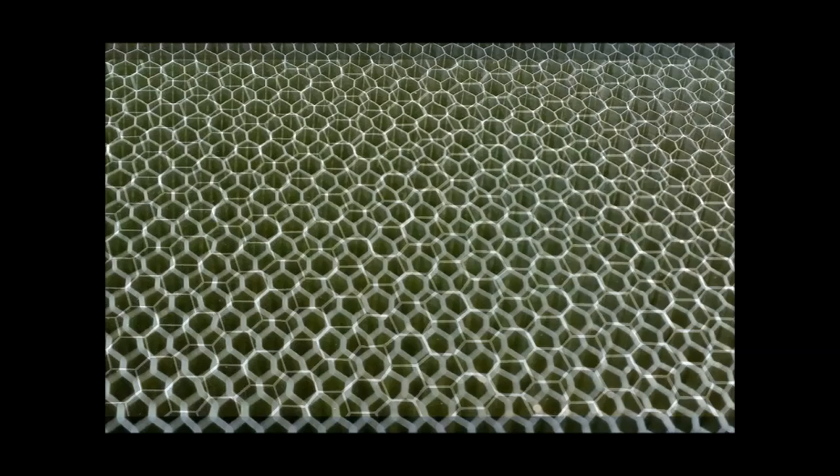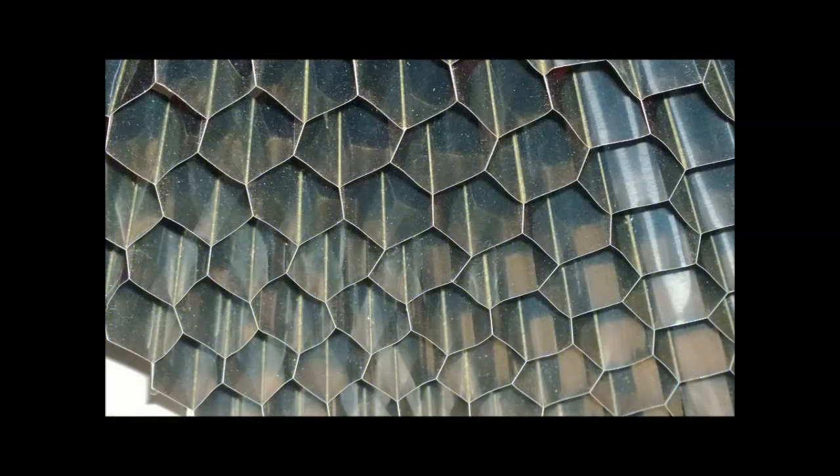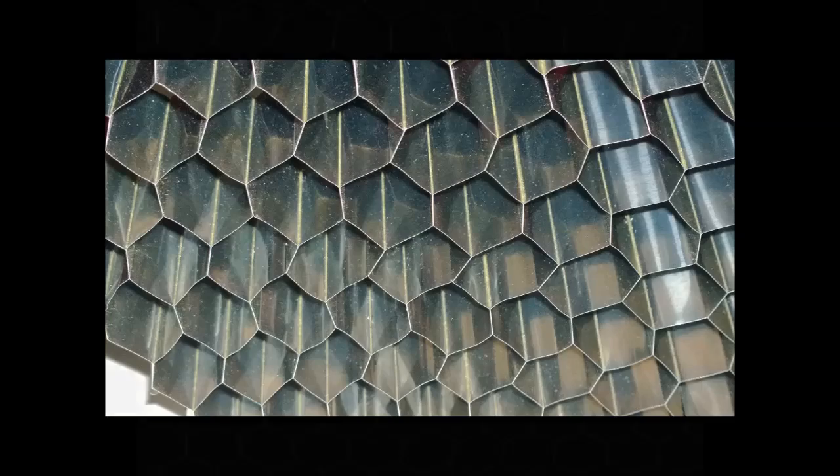Core substrates are the foundation of panels. This core is comprised of 1/4 inch aluminum honeycomb with a 3003 aluminum alloy grade. The hexagonal cells are 1/4 inch in diameter. This is a structural grade aluminum honeycomb core used for emergency vehicle flooring, commercial trailers, and structural wall cladding.